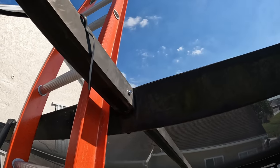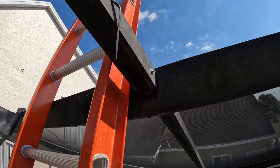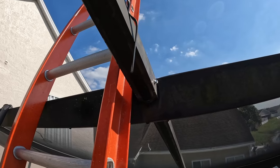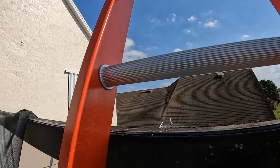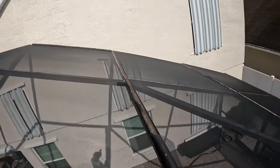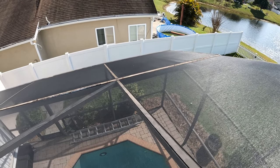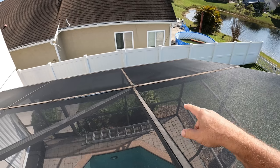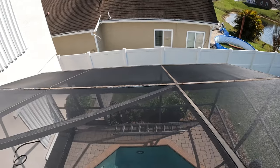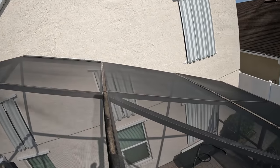What I'm doing here is tying in every one of these 2x2 aluminum beams. I'm putting in 304 stainless and locking this frame in for the high wind events we have here. The last hurricane we had a few months ago took out the two bottom panels — number one and two at the lower section. I replaced those, but typically what you want to do with these screen enclosures is start at the top and work your way down, one through three.